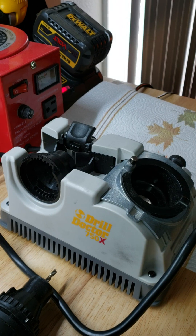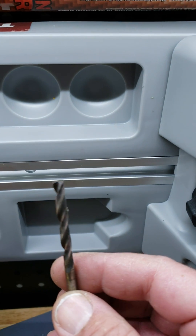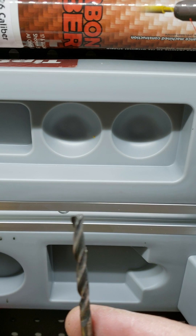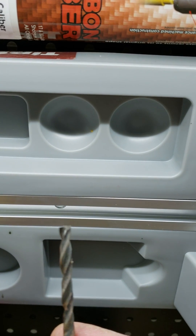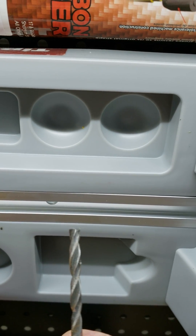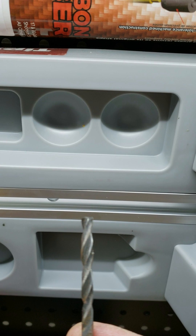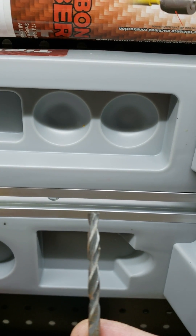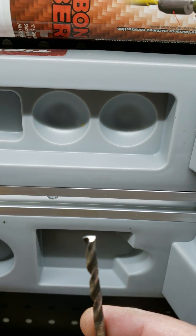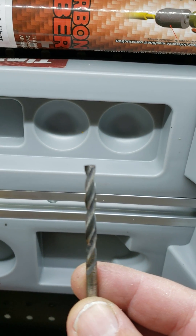These drills were really bad and here's what was happening. I wanted to sharpen my drills at a 135-degree angle. There are two prevalent angles: 135 and 118 degrees. The Drill Doctor can be set up for both, but adjusting it was quite a chore for me at least. There might be people who know how to do this in their sleep, but not me. You can see that drill head is almost flat — absolutely horrible.